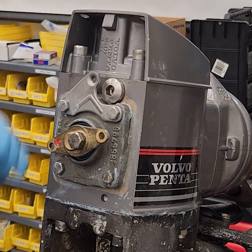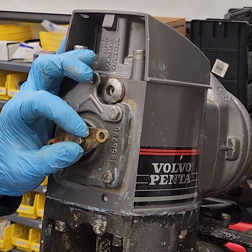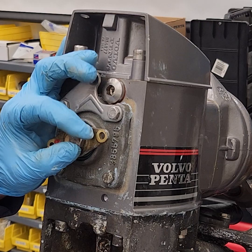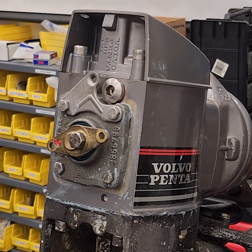I've taken all the shims off. Now I'm going to start turning the prop shaft counterclockwise. As I turn it, I can feel some tension from the rolling torque, but it's not excessive. I'm going to turn this screw in until I just can't turn that shaft — as soon as that prop shaft stops, I can feel it's locked up.